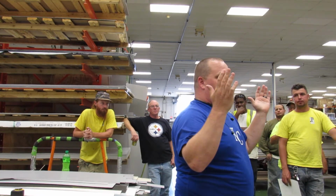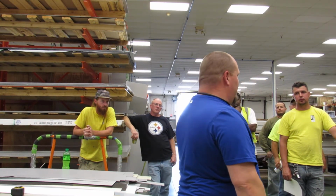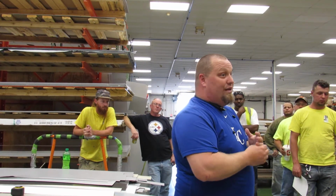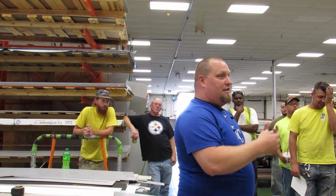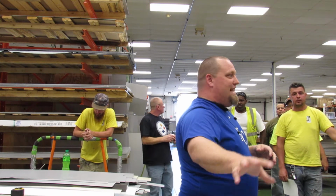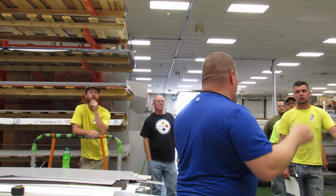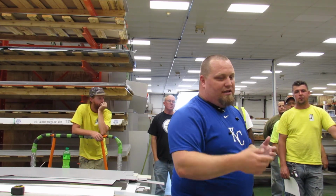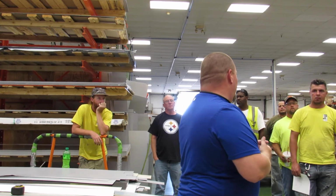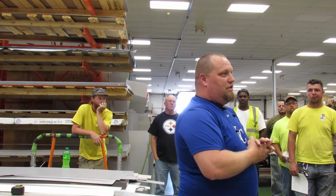Just like our subsill has end dams, metal panel systems that take on water have an end dam system at the edge of a window, the edge of any opening. We have to understand and know how that's working. If we don't, we have no clue. Exactly, we have no clue if we're accepting something that's right or not. A lot of this type of metal is how most of those metal panel companies close off their openings. Jeff Shawhan showed me a lot of these things and how they do it, just as I thought I knew what we needed to do, to get some reassurance that we are correct. But this type of lapping is what they're usually doing with their systems.